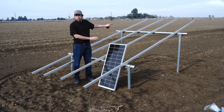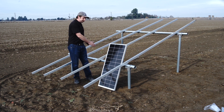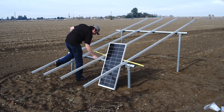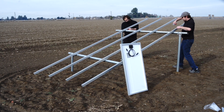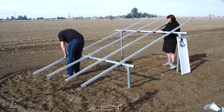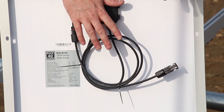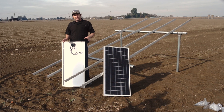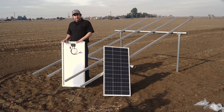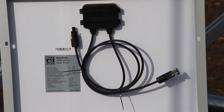With the panel rails lightly attached to the posts, we can get the solar panels. First, find the center of the solar array using a tape measure, then divide the solar panels into roughly thirds to find the position of the panel rails. With the panel rails bolted into position, it's time to start mounting the solar panels. Take a look at the wires on the solar panels for the series connections. Start at the bottom and place the two bottom panels using the end clamps, getting them nice and square, so the rest of the array builds up in a nice line parallel to the rails.